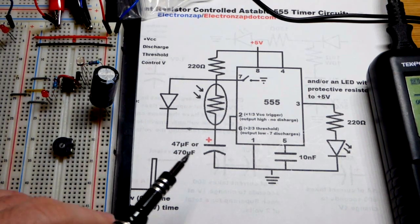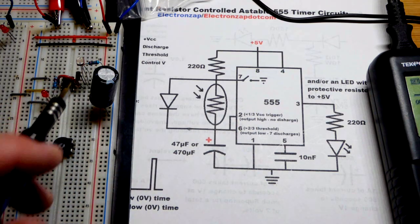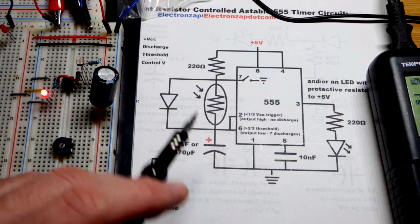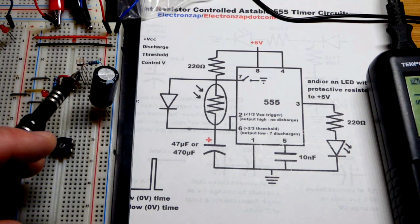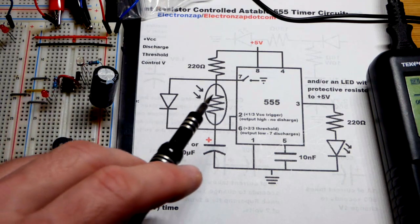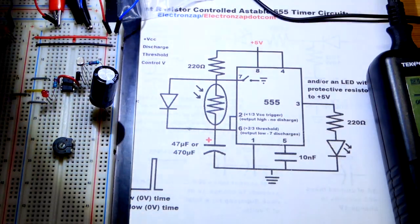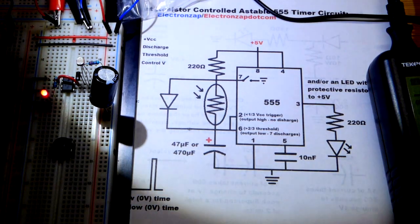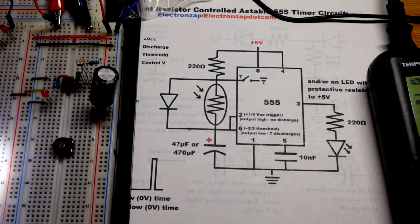In this video we're going to start with this circuit here. This is a 555 timer, the NE555 timer wired in astable mode, so the output just keeps flashing high and low. The speed is mostly determined by the capacitor but also the light dependent resistor here. As its resistance changes as light falls on it, I get a brighter light on it, you see it goes faster. I zoom in the light so it's more intense, it flashes even faster.